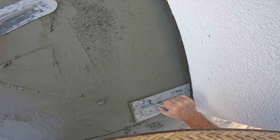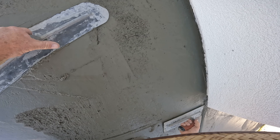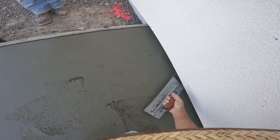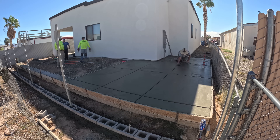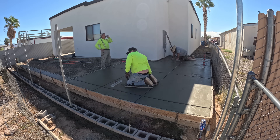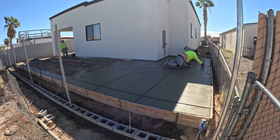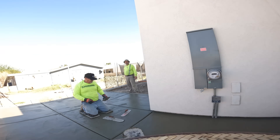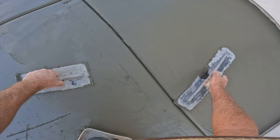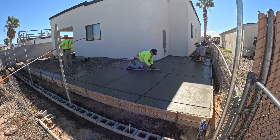It's about that time to get out there on the sliders. I'm using the fiberglass sliders — I prefer those over the steel ones because you have more control with them, they're a little bit wider, they don't slip around so much. Because when you have a lot of upper body strength and you're pushing on those trowels, if you've got the metal sliders your whole rear end starts spinning, so you need the fiberglass to kind of lock that in.